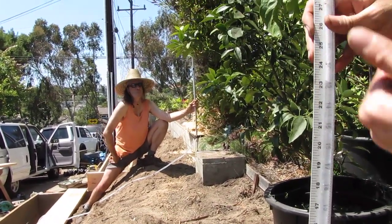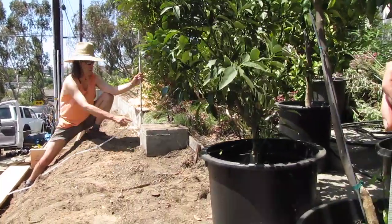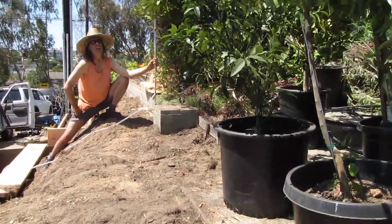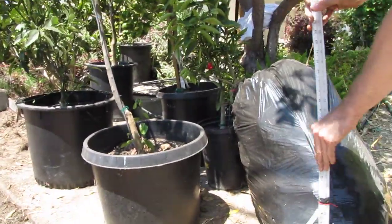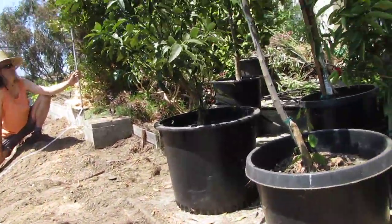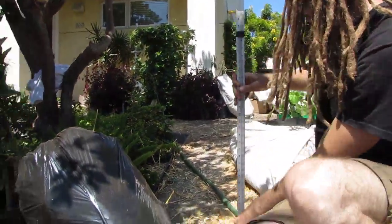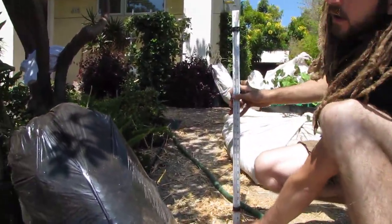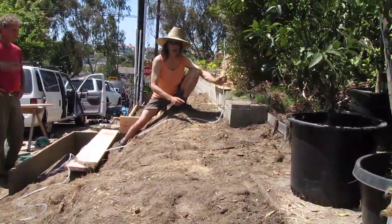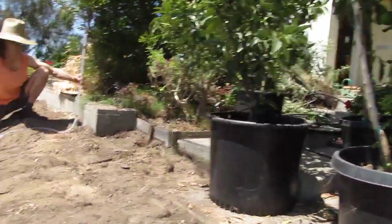Each of us is right now at 22 and a half, although I'm not actually touching the ground. I wanted to measure at this point. If we're trying to find a level line off that, we're not going to be in the soil anymore, I don't think. The more we move this line, it distorts it, but then you let it sit for a second and the bubbles even out. Actually, what I'd like to do is know the corner. So let's start here. You'll have to remove it off there. What we do is take the bottom of the ruler as 0.0. That's level to this point.